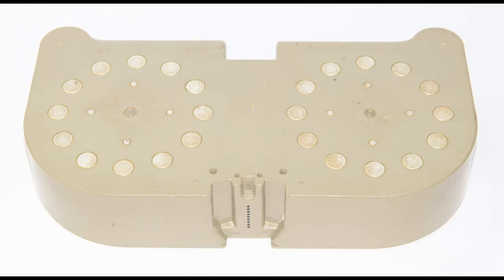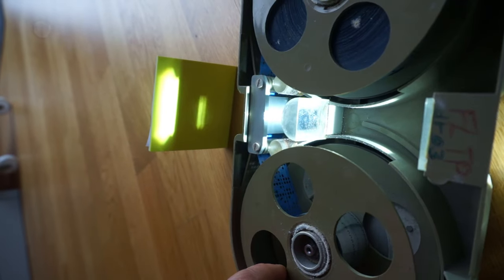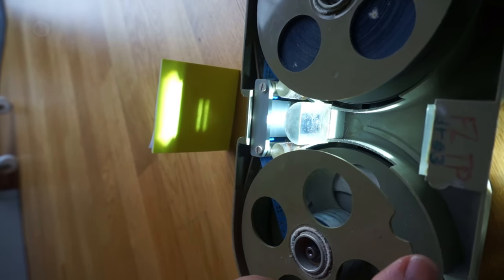Inspection shows that the reels inside are driven by magnets from the program loading unit. Inside the cassette there is a cylindrical lens for focusing the light through the cassette onto the paper tape. Eight small light guides make the light available to photodiodes inside the program loading unit.